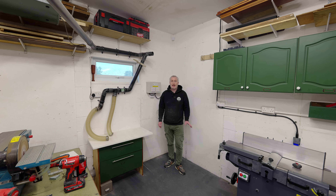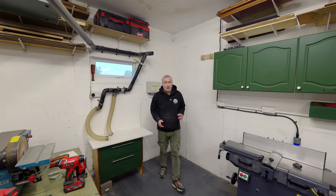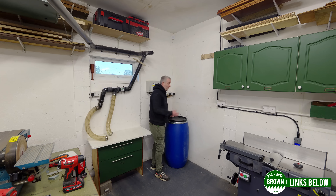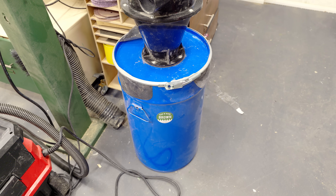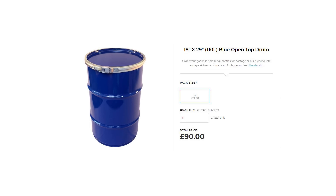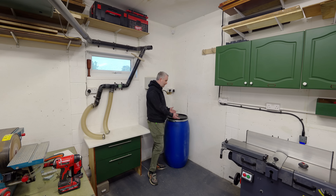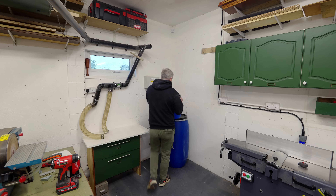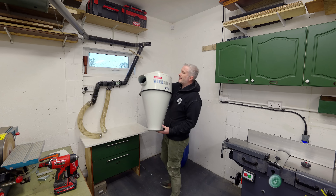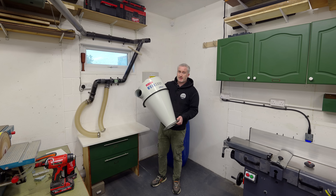So I'm going to be setting up the new extractor as a two-stage system - I think it'll be easier to explain once it's all set up. I'm going to need some more components: first is this big plastic barrel. I wanted the metal one originally, similar to what I use on my vacuum extractor. You can get the big 210 litre ones for next to nothing but I didn't want anything that big - to get one around 100 litres you're looking at about 90 pounds which is way too much. So I settled for this 46 pound, 150 litre barrel which is nice and slim. I also picked up a tiny 20 litre barrel and this massive 100 millimetre cyclone courtesy of Axminster, which I believe is the only 100 millimetre cyclone available in the UK.